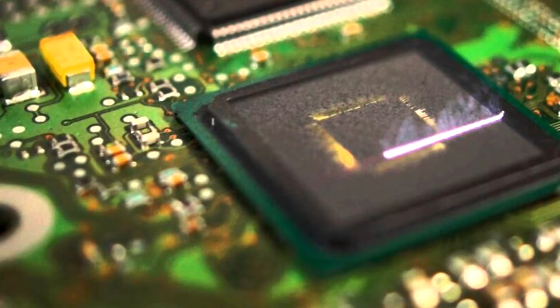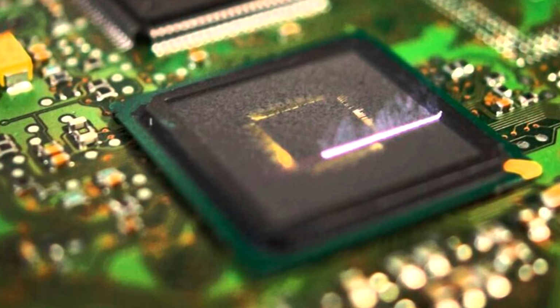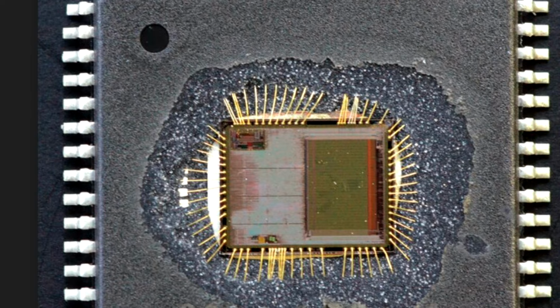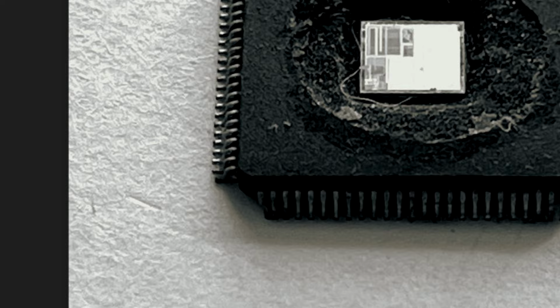Moving on to flash memory, this is meant for long-term storage of firmware and doesn't really mean much in terms of a gaming mouse's performance. If you can get the same firmware done on an NRF52833 as an 840, it really doesn't matter.